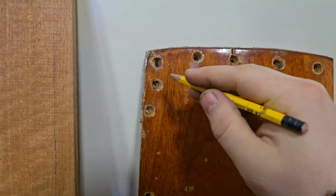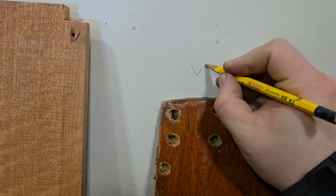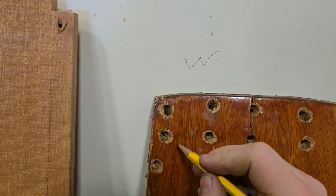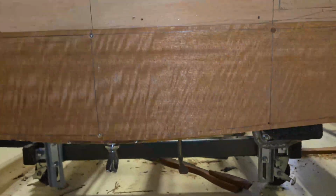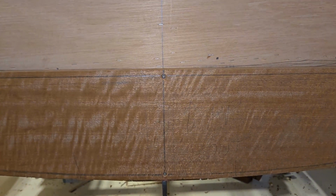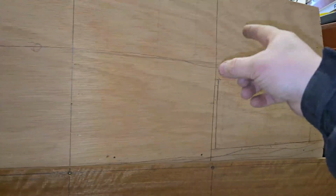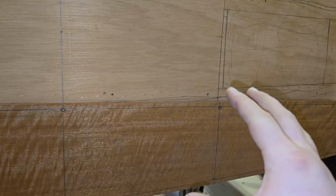So it's really imperative that when you do this, you stitch the design together kind of like that on here. So here I have a couple of fasteners in the back. Right now I'm currently just using 8 by 3/4 fasteners on here. Now typically for the battens you want to use 8 by 3/4 so that you're not blowing the battens up. They're very small in some areas.